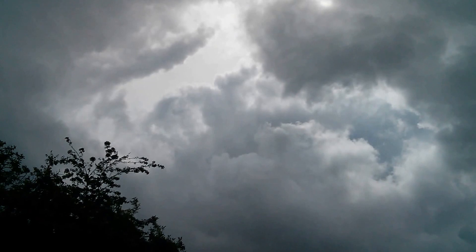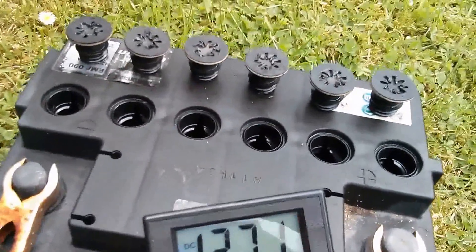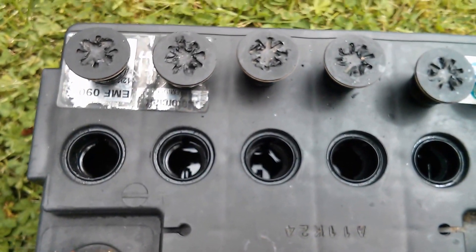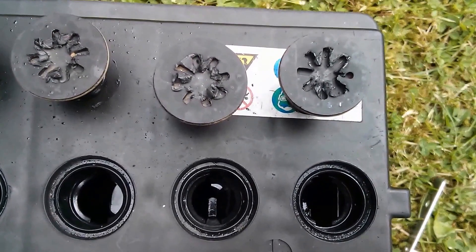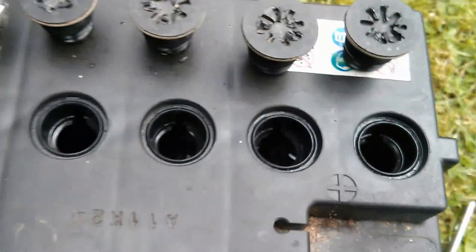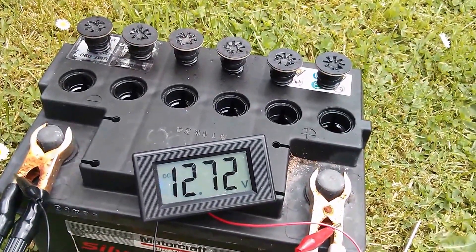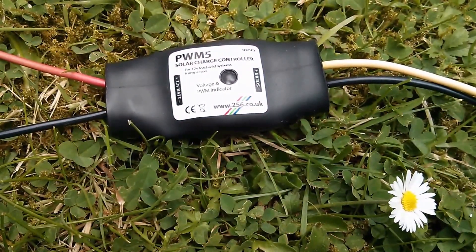So another day and another type of weather — cloud. We've lost our Mediterranean Ibiza weather and we're back to normal now. So this had a day really bubbling away. Cells 1 to 4 are good and cell 6 is good. So it never managed to restore the 5th cell. I don't think I can use this in my battery stack still. Nevertheless, it does make me think about equalization, and I'm thinking about equalization in terms of putting it into a charge controller as a feature.